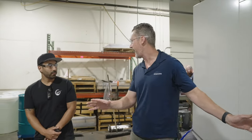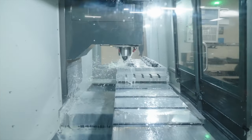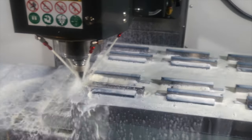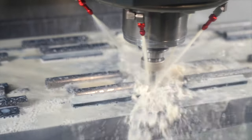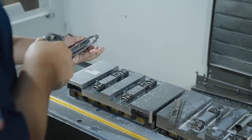All of this is slide manufacturing. That raw block of steel goes into one of these three machines. You can see this one running presently. By the time it comes out, it starts to resemble a slide — it'll still have a square top, but the bore is drilled here. Working down the line, you start to get the round top. On the other side of the facility, serrations are added to the slide, as well as sight cuts. If it's an optic-ready gun, it'll get the optic cut there; if not, it'll get a dovetail for the appropriate sights.